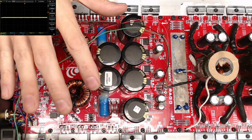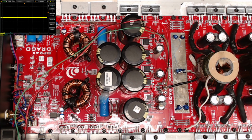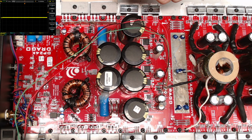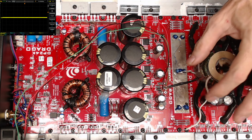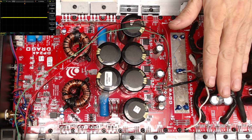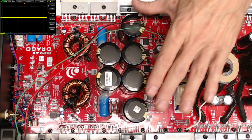So this is just another method of powering up an auxiliary power supply, besides using my plus minus power supplies. I'm just using a standard amplifier power supply to drive this, which works perfect. I'm just substituting the windings from this transformer with a separate power supply. It's doing the exact same thing that this transformer is doing, which is allowing us to not have to worry about building rail voltage.